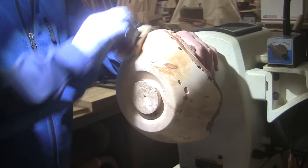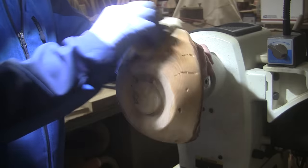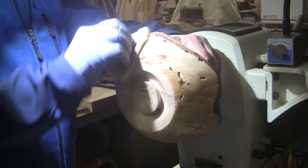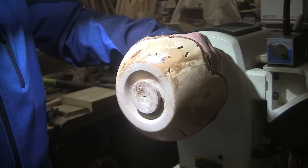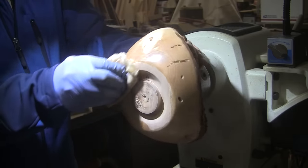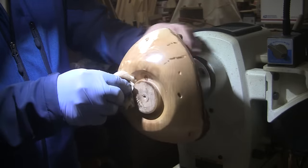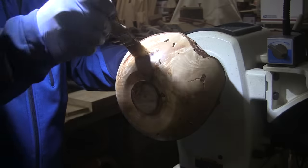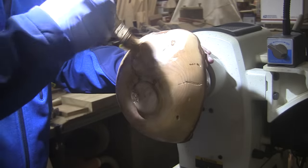I need to be able to see my way back into the house. This is a shellac-based sanding sealer I'm applying — it's called Zinsser Seal Coat. Then I will apply Zinsser Shellac over this, although you don't have to; that's just what I like. You can apply any clear finish over it. I'll put on two coats of this and then two coats of shellac. I have a short video on my channel about smoothing between finish coats — look that up if you want to know what I do in between. Now I'm going to need a brush to get into some of these bug holes; they don't look too bad once you get some finish in there.